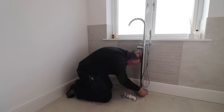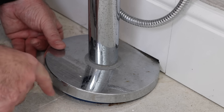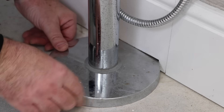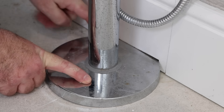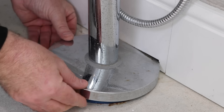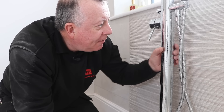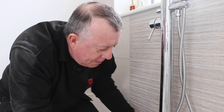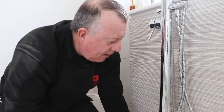To take this hot and cold away, I need to take off the plate to get to the screws underneath, which are bolting it to the floor. But it looks like this went in first, and then someone cut the skirting around it to make it fit. So now I can't take the base plate off without taking away the skirting. If I wasn't selling the bath and this set of mixer taps I might just cut the base plate off, but I'm going to need that to sell it. So the only thing I can do is take off the skirting.